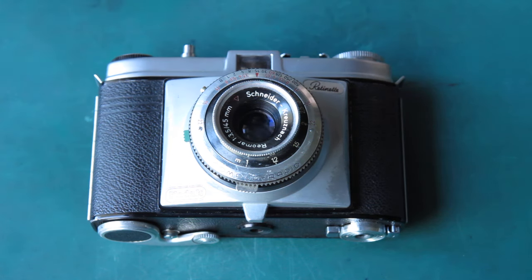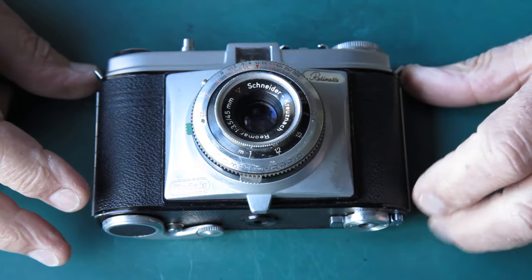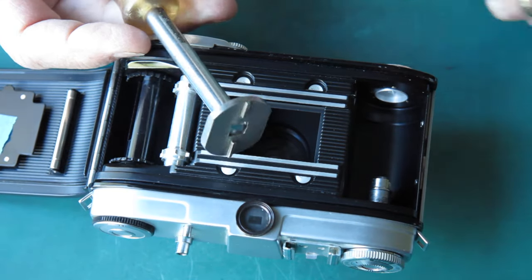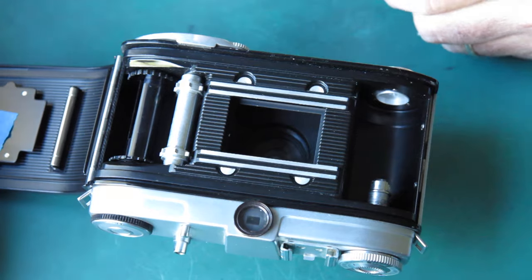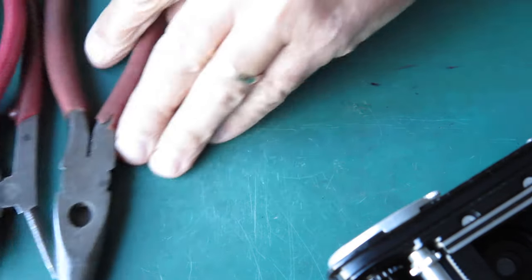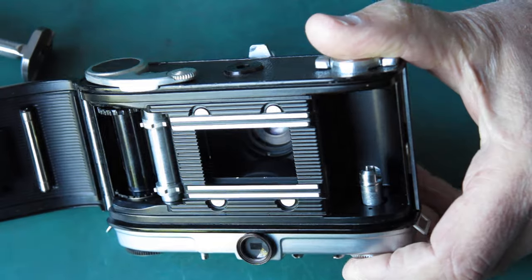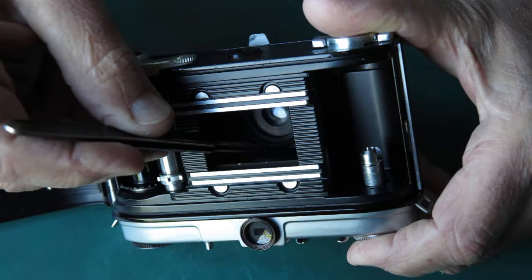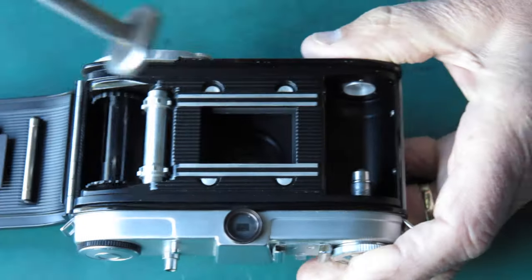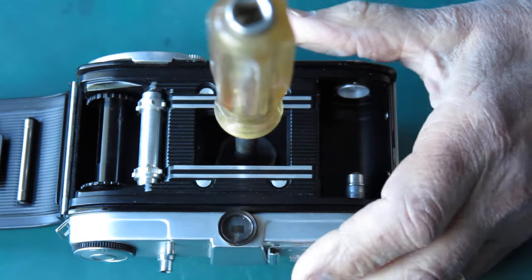Okay, everybody wants to skip onto the glamour part of the job, which is dealing with the shutter. So we might as well start with the shutters. This is the earliest of the three cameras, and we need to remove the shutter from the camera body. I'm going to use this tool because I've got it. You can fight with whatever tools and methods you've got at hand. I'm taking the easy route. Looking in here, I can see my notch that the tool needs to engage, and that was just a bird thumping off the window, nothing to be concerned about, is right down in there. This tool should reach that quite nicely. Drops into place.